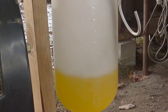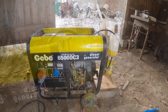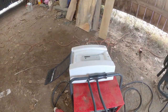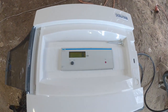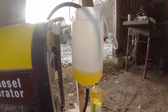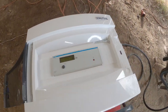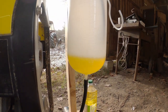I now add 0.4 liters of diesel fuel and I will run 0.3 of them. I have connected the generator to a nine kilowatt heater that I'm running on half speed. Zero kilowatt hours so far, and now I have been running for a short while and so far we have got 0.1 kilowatt hour.